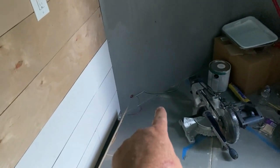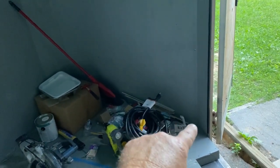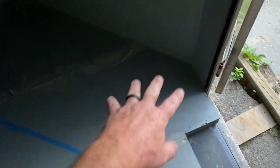There'll be five switches: two for lights above the water area, and the wires coming out of the bottom — you can only see one — but those are going to be for the water pump, the shower, and the sink. That last light is also hooked to a wire that runs out right down here and is going to be for an exhaust that goes to the composting toilet inside the bathroom area. The blue lines on the floor mark where a wall is going across with a door, and all of that will be the bathroom area where the shower will be.